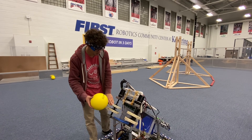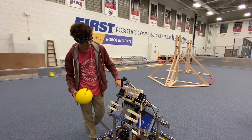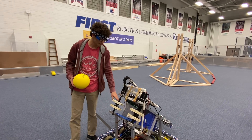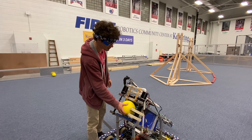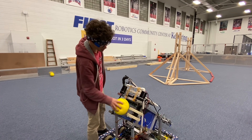The wheels are just standard AndyMark wheels from a kitbot chassis. The motors are mini CIMs, one on each, and they are going into 3-to-1 VersaPlanetary gearboxes — that'll spin these up. The wheels also have the bonus of being our hard stops for our hopper here, so that none of the balls can jump out while we're running it.